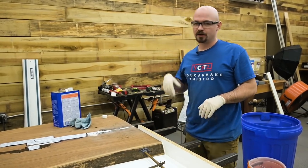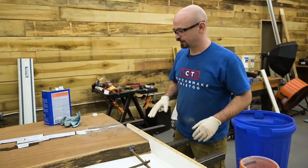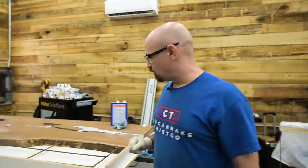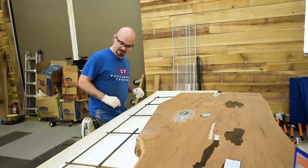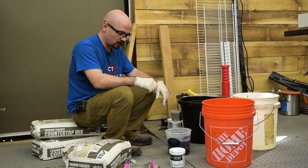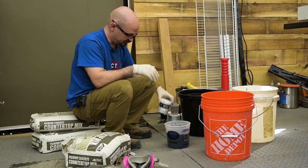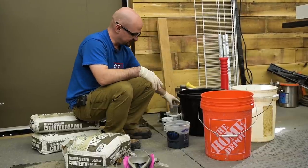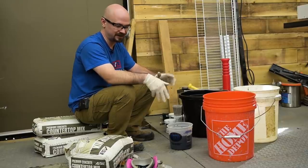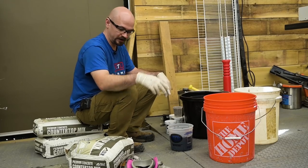Just finished cleaning out the mold really well — vacuumed it, blew it out with air, wiped it down with denatured alcohol, and did all that again. I don't have a wide enough sheet of melamine, so I used two for the mold, with another sheet on the other side to keep everything level. Checked with a level — we're all level. Rebar is tied and the four-minute epoxy I used to hold the rebar in is set. Ready to do the scary part: mix some concrete and pour it in. This countertop mix is very picky about how much water you use — you have to be very consistent. Got water buckets and a measuring bucket. This is also being tinted with some generic sack cream concrete tint. Being consistent with water means I can be consistent with measuring the pigment so everything is the same color. Add the pigment to the water to make sure it's thoroughly mixed before adding the dry mix, so we don't get streaking.